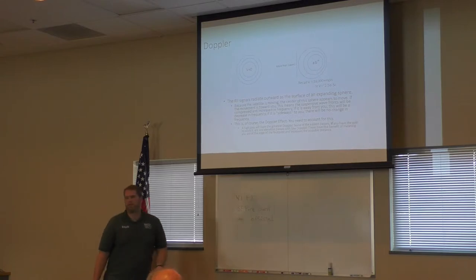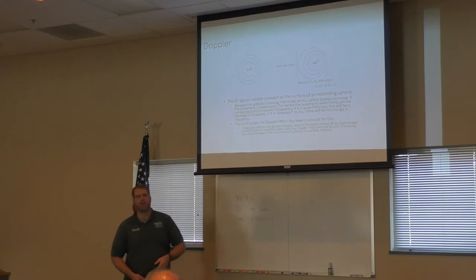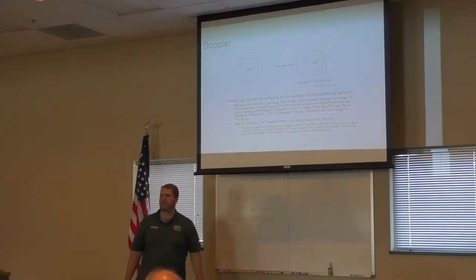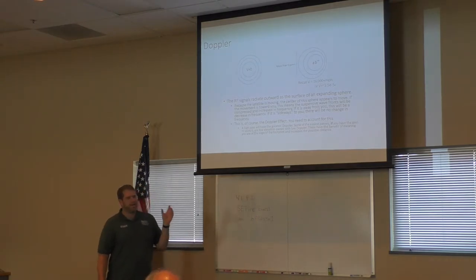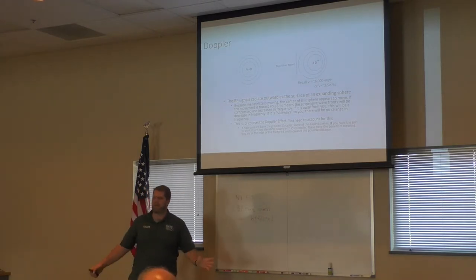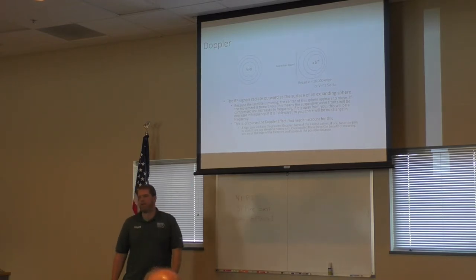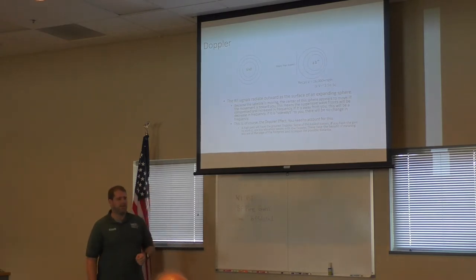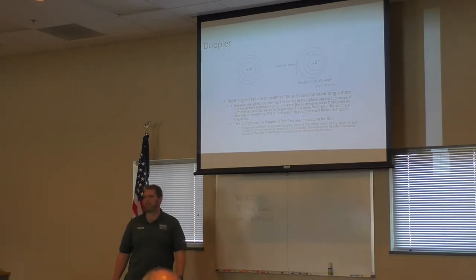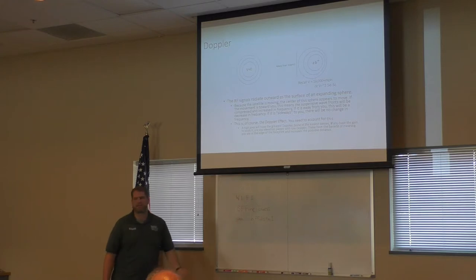We need to account for that, because when you're going up on a ham radio satellite, usually it's these Mode B or Mode J. You're going up on either 70 centimeters or 2 meters and vice versa coming down. 70 centimeters is a lot more waves per second, and it's affected by this Doppler a lot more because of that. So as a percentage of the speed of light, basically, as your frequency gets higher, your Doppler shifts get higher. The upshot being, you could be tuned center channel and not be making it into the passband, uplink or downlink at all, depending on how the satellite's moving. Okay. Less of a problem on 2 meters. Most of these charts will show you, if you're downlinking on 2 meters, you set it to the center frequency and you forget it.